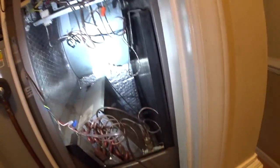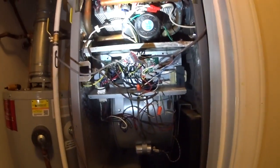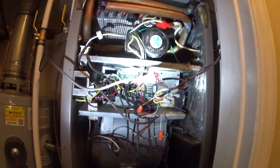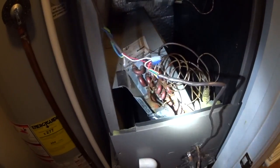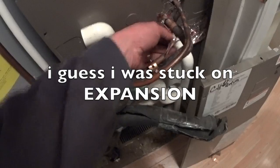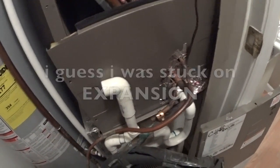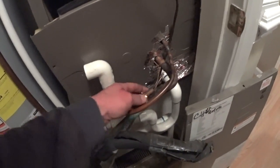What I was going to do while we were getting the refrigerant out of the system was check my airflow, so that once we were up and running we would have everything ready to go. We're going to take that expansion bulb off the TXV and relocate it to a better location. We got the expansion bulb relocated outside the cabinet where we can get a good returning refrigerant reading, and we're just going to insulate that.